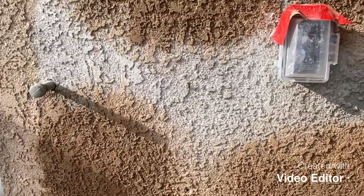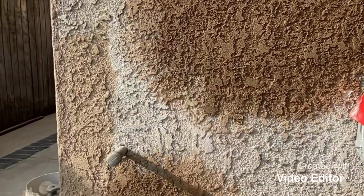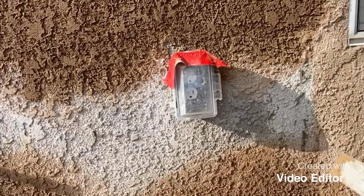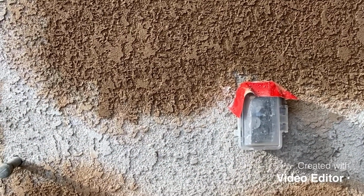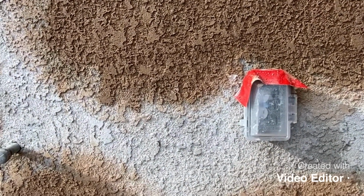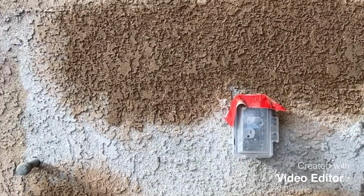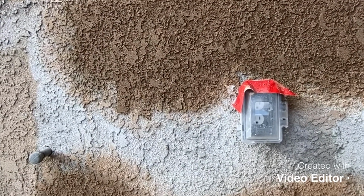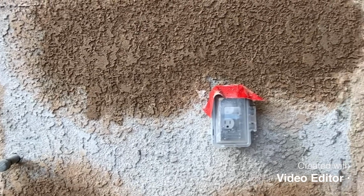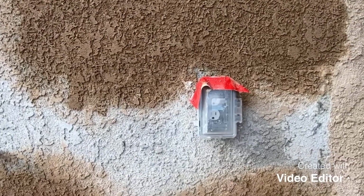So now what I'm gonna do is shoot it. This is the original stucco, this right here. So you don't really need a bonding agent. I mean, it's just a little bit that we're gonna shoot on top of the paint. So don't get all crazy about bonding agents or whatever. All this stuff that I bought for this patch was purchased at the Home Depot. You don't have to go to any professional store. You can just get it from the Home Depot. Skills pays the bills, right? So we're gonna go ahead and shoot it, and we'll see how it looks.